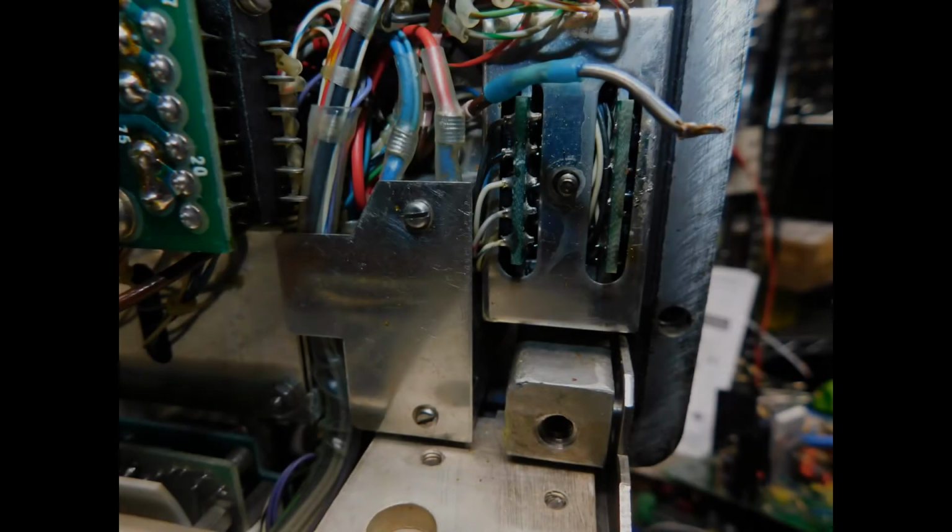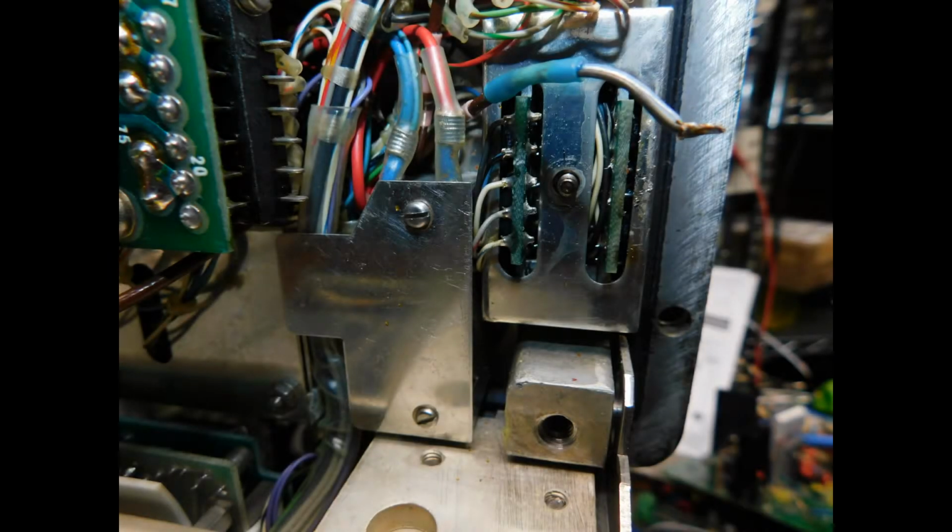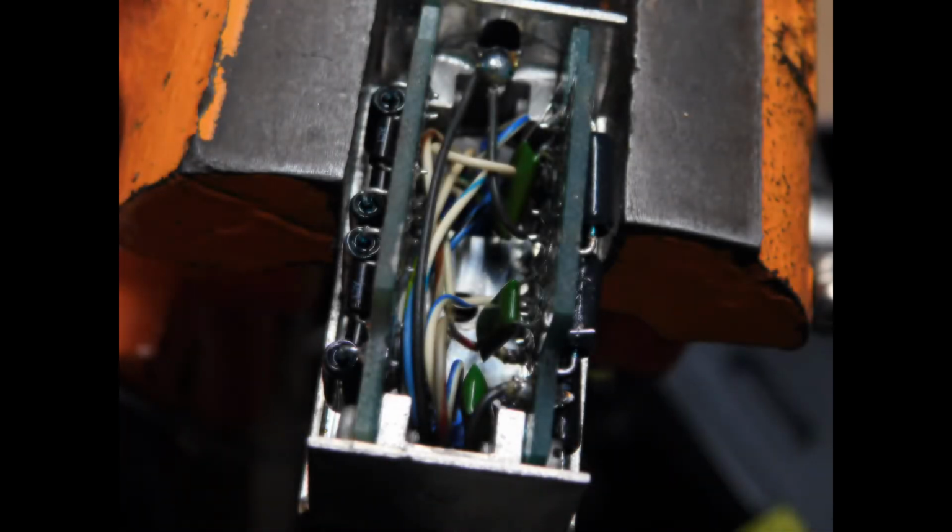So I removed all the bolts from the case, removed the radio, and I removed 2 bolts, and that allowed me to flip the front panel out of the way. I then disconnected the press-to-talk lines from the PCB that is on the front panel. It's right behind the panel connectors.